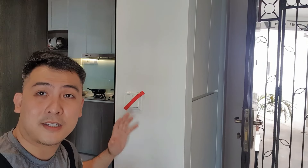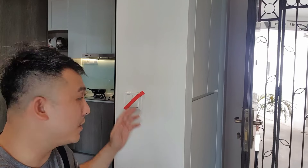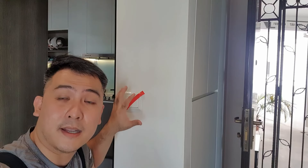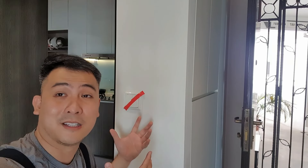In today's episode, what we are looking at is a light switch that has been sparking. So when you turn it on and off, the lights inside flicker and it starts to give off a burning smell. You don't want to leave it like that — it means that it's arcing, the contacts are loose and it may even result in it burning and melting. So it's not safe.